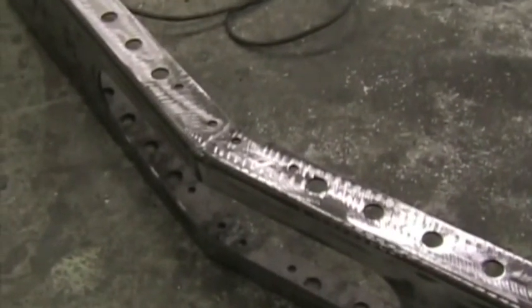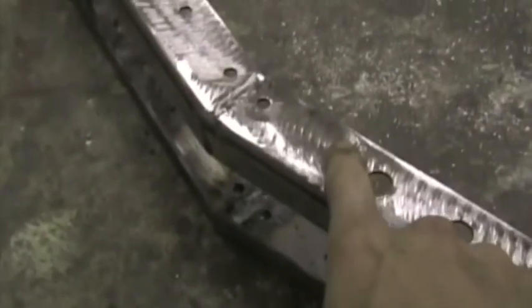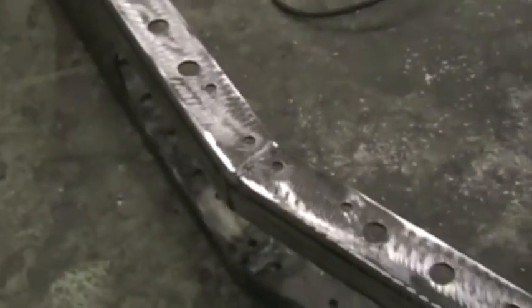This one I've chosen to weld at the center, but in the kit you also receive a steel bracket that attaches to these four points to prevent having to weld that joint. The steel backing for the undercarriage is now bonded in using cotton flocks, and I've held it in position with two temporary 10mm bolts. There's the one, there's the other one. Force the cotton flock in all the way around the steel backing and make sure to clean it up properly before it sets. It's a lot easier to clean it now than when it's cured. There you can see the cotton flock between the steel and the rear face of the carry through spar.